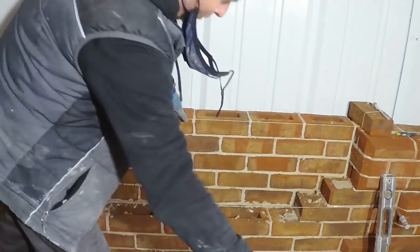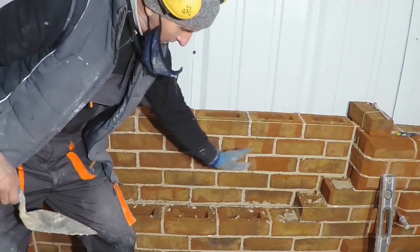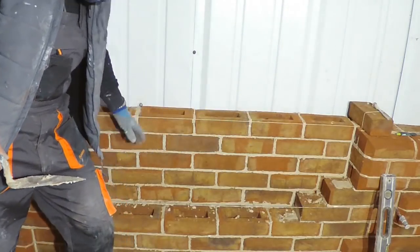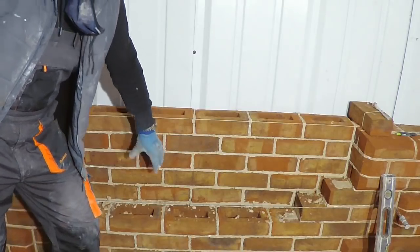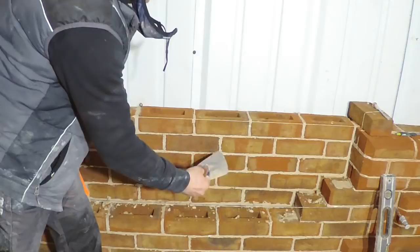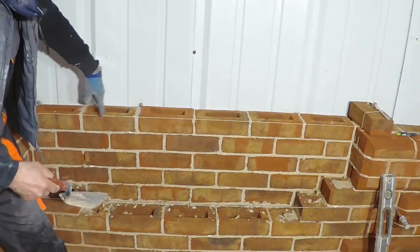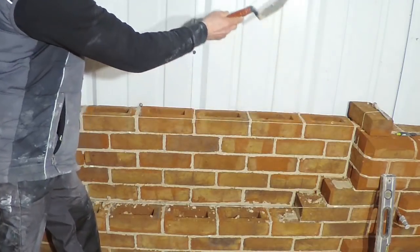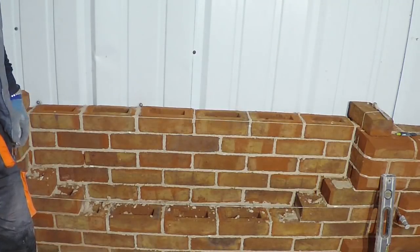Right, this is just the back wall, so I'm just taking this up. Obviously, the one in front is going to be the circular ramp that we do on it, or the bottom of the bullseye. And then obviously we'll put halves round on there. The idea is to have a stretcher there, then halves come around, and then another full brick there and full brick there, and from that we'll bring the arch up. So that's the plan that we have.